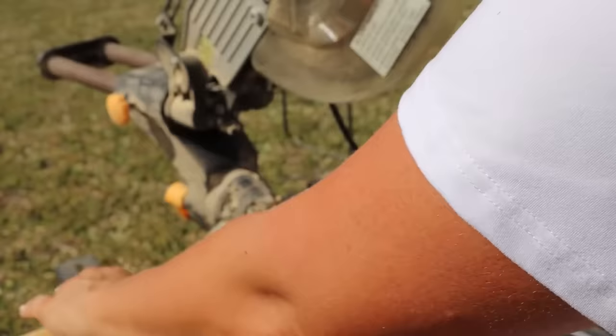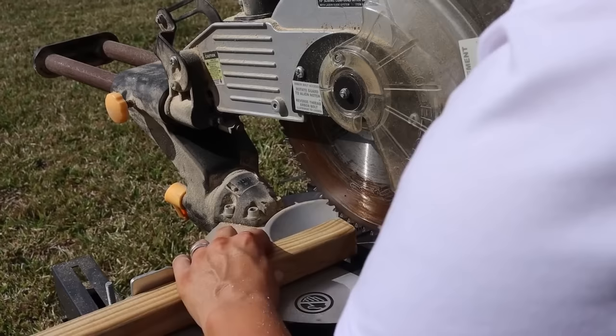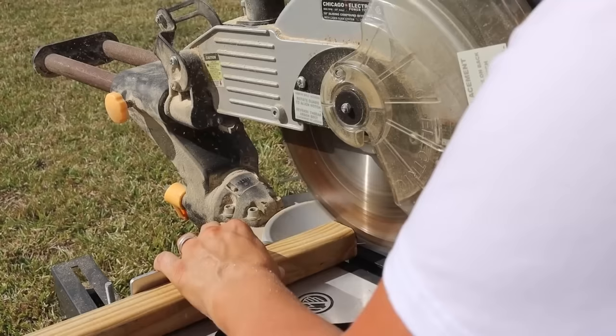So with our side pieces, I cut them down to 18 inches. And then I wanted it to lean easier and not be lifted up. And so what I decided to do was put a little angle on the bottom, and I ended up cutting those bottom pieces at a 10 degree angle. And that's just so it would lean nicer up against the wall.